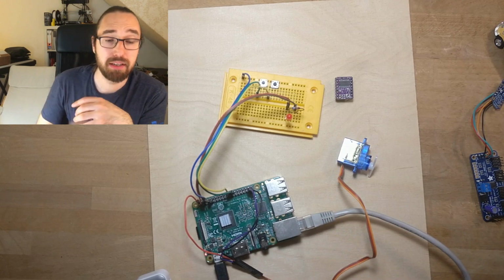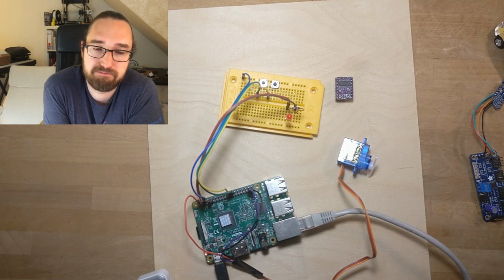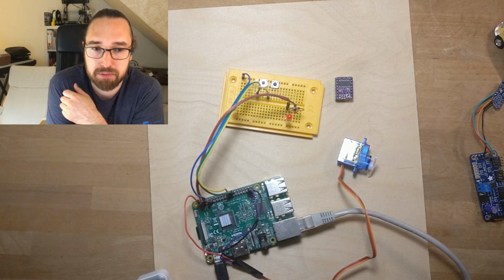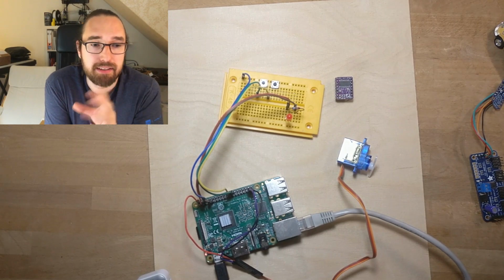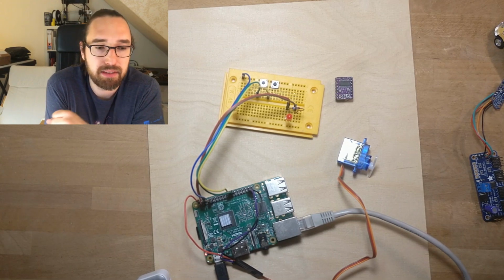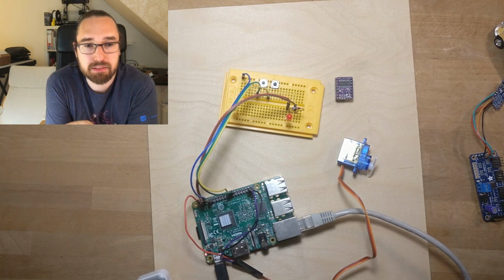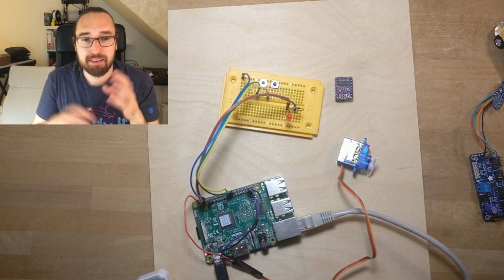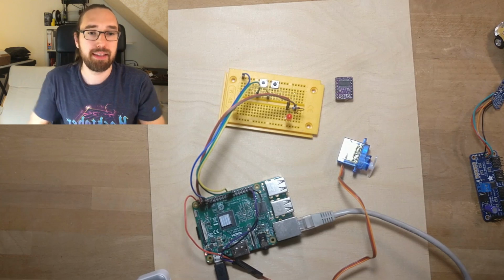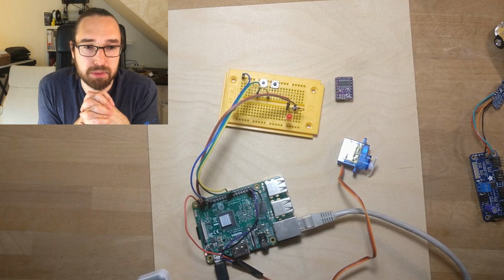Boot times were a little bit long, but on the Raspberry Pi 4, it's about 10 seconds into MPF with the media controller running. That's totally possible depending on your assets, but the boot time of the Raspberry is sometimes 6 seconds or something with a graphical interface. So it's possible to do a production game with it, but it will really require some tuning at the end, like finishing engineering. But if you're willing to do that for a production game, it's possible.